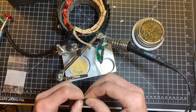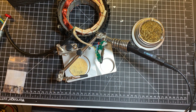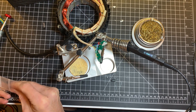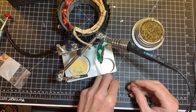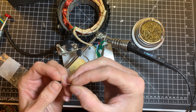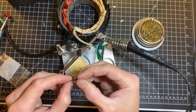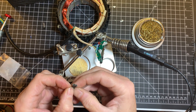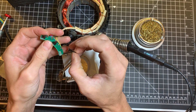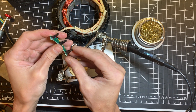You will need to reuse the bracket for the Hall sensor. There's a little crack here, but since the Hall sensor is not really - I don't care much for it - I'll just remove it. Take a new Hall sensor and put it in. There's a notch on the Hall sensor - actually two notches - and it's the same on the bracket; you just need to match those. There you go, you've got your three pins. Put it back on the PCB and spread the legs a little bit, just like that.